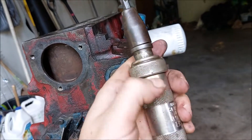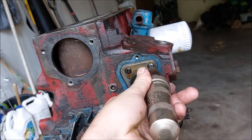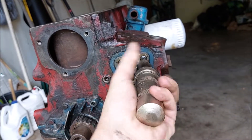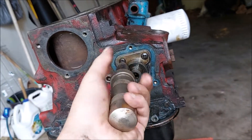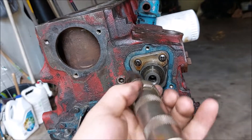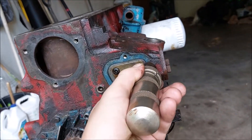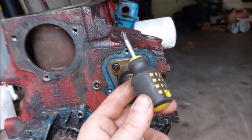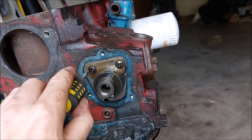The way it works is you turn it so it's set to spin counterclockwise, then you hit the end with a hammer and it just turns the screw to get it loose. The reason it's a good tool is because it applies pressure and twists at the same time, which is pretty hard to do with a regular screwdriver.